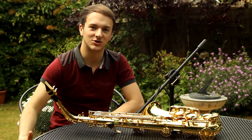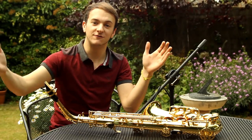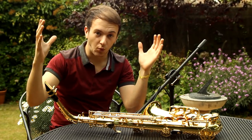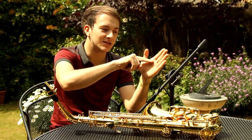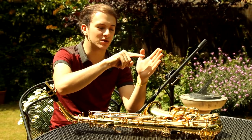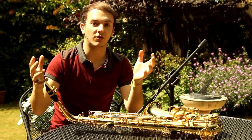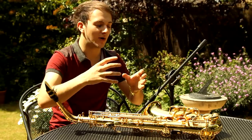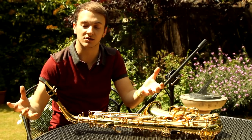You're probably thinking: I've seen 30 Hz tuned T-Line boxes and they're nowhere near that big. What I've realised is you can actually tune a box to 30 Hz without using the full 30 Hz wavelength. A frequency can resonate at a quarter of the full wavelength — just from the centre to the peak. So rather than needing 452 inches, the box only has to be 113 inches long. That's why T-Line subwoofers use a square box with a folded line or folded tube equating to the desired quarter-wavelength length.